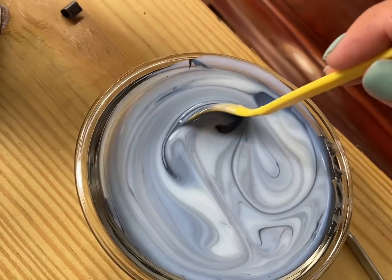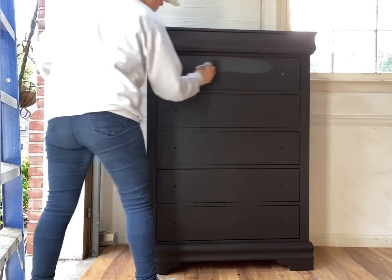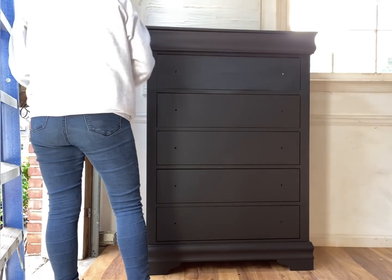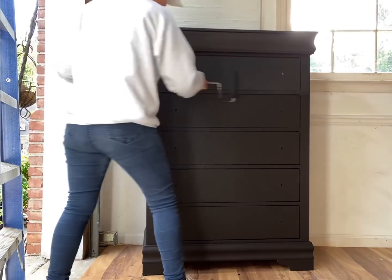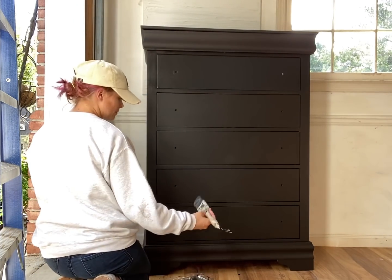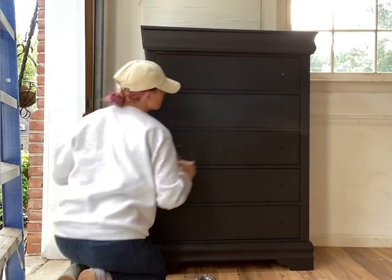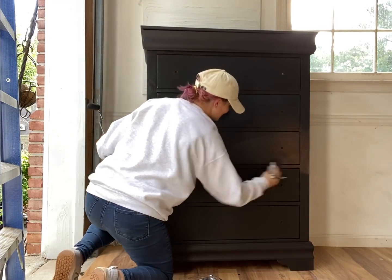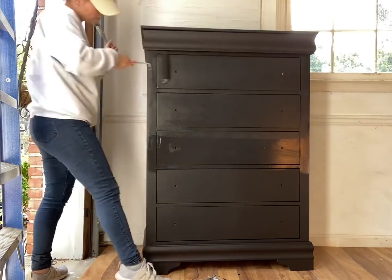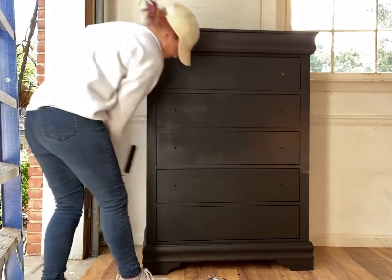Here is your awesome viewer-suggested technique: mixing the clear coat and the milk paint together. How much you choose to do is your call — I did about a one-to-three ratio, so one cup of paint to three cups of clear coat, and I felt that worked really well for me. You can also apply the clear coat straight on as in my other video, but I really wanted to try your suggested technique and I'm a big fan — it worked really well.